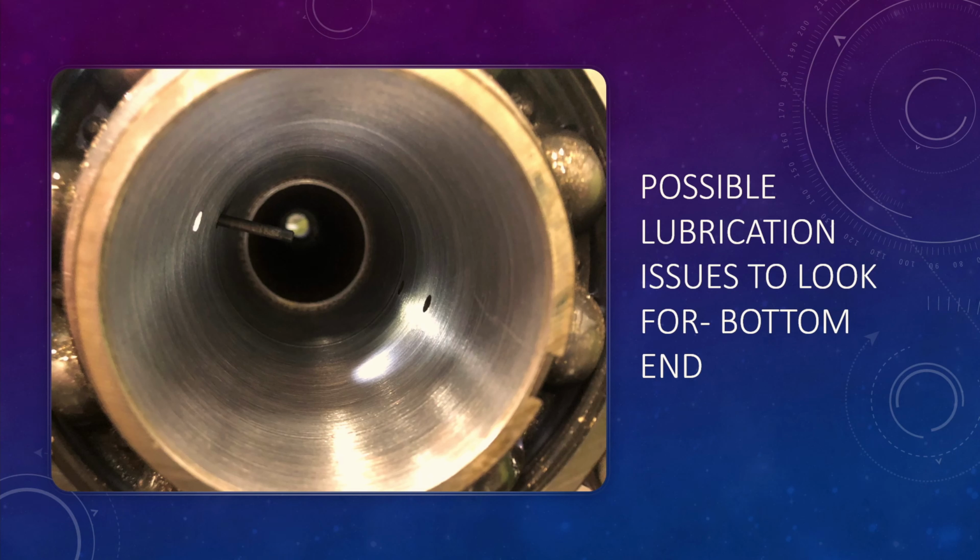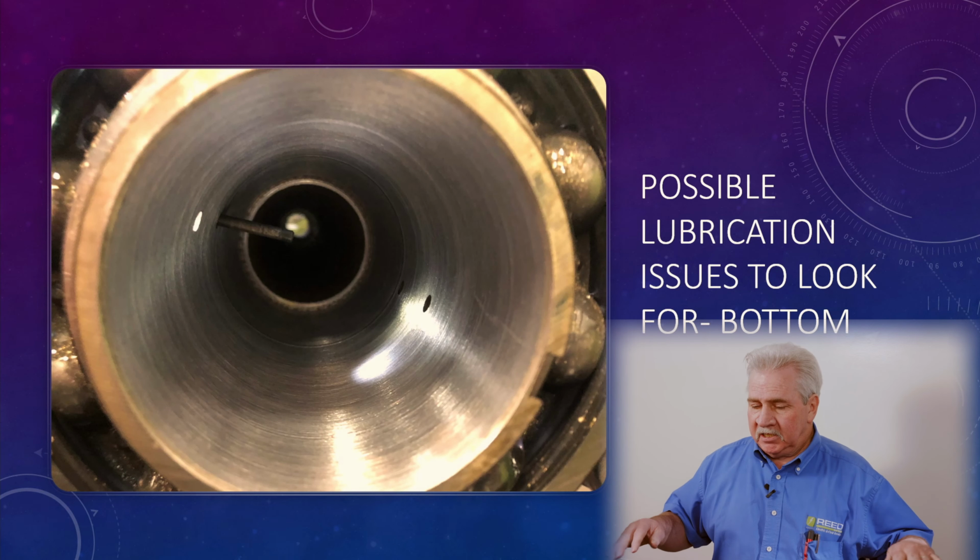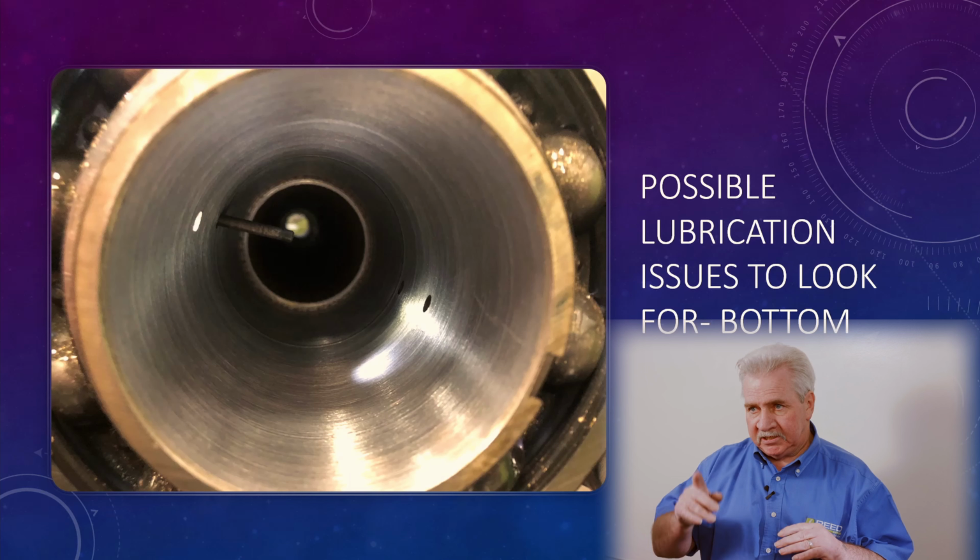So if you look at this picture, I put a screwdriver in that hole to show that the shaft is actually machined further back in now, so that we can put the steady bushing above both of those holes. We've been seeing a lot of the lower brackets come in saturated the hell out of with oil, and this is part of the problem.